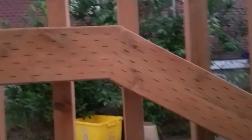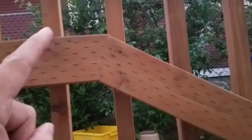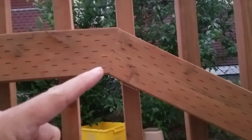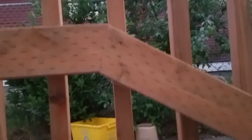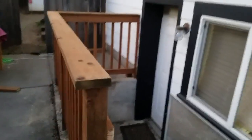All right, the railing's done. 60 degrees to 90 degrees, 36 inches off the ground. So I didn't film me cutting it because there was a whole lot of mathing, but to give you an idea, 60 degrees off a vertical, 90 degrees off a vertical, which means 30 degree difference, cut in half, 15 degree cut. And that is screwed in there, anchored there, anchored there, to the 4-inch post and to the bottom rail over here. And then this edge right here is beveled so that it is not a hook point. If you're walking down the stairs, you don't want to get a purse string caught or your shirt and trip and fall down the stairs. So that job is complete.